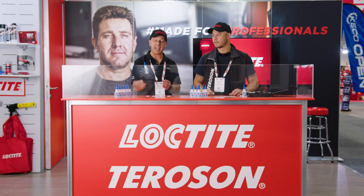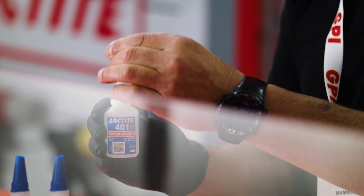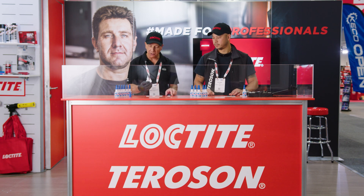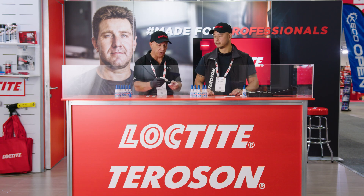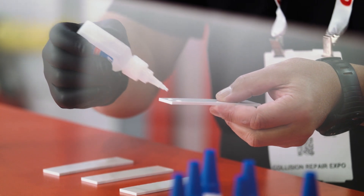Now when you open up a brand new bottle of one of our CAs, you might hear a small out-gassing, which is basically showing you that the product is fresh. The secret with these is always keeping the bottle upright. The biggest mistake we find in the industry is that people use way too much. So we're going to do a quick demonstration showing you how quickly it bonds two bits of plastic. Now these are not gap-filling products, so they always need to have the surfaces touching together.